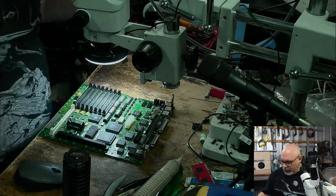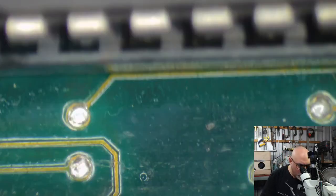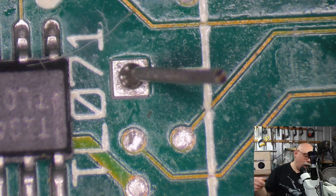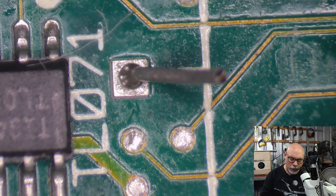All right, okay. Let me get some work done. I'm going to start cleaning up these pads. Well, actually, how about I pull out these pins first for these re-soldered caps. So this person did actually recap this with new axial caps, but I'm going to put new ones in because people pay me to recap. They put in a 35 volt in replacement of a 16 volt. I generally put in a 25 volt and replace them with 16 volt, but you know, it's okay to go up in voltage, but you don't want to go up in capacitance.